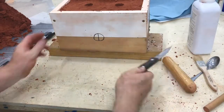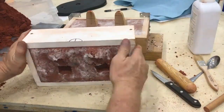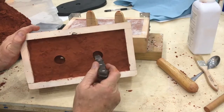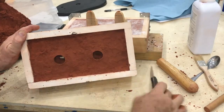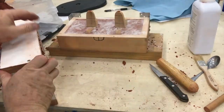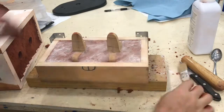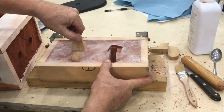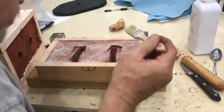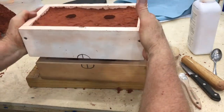Once that is completed, the mold must be carefully separated and the wooden masters removed. The pouring holes are cleaned out so the aluminum can go in there easily and any debris is blown out. Then, by wiggling the wooden masters a little bit, you can get them to pull out and leave the cavity. So you now have two cavities that, when joined together, form the complete part you're trying to cast.